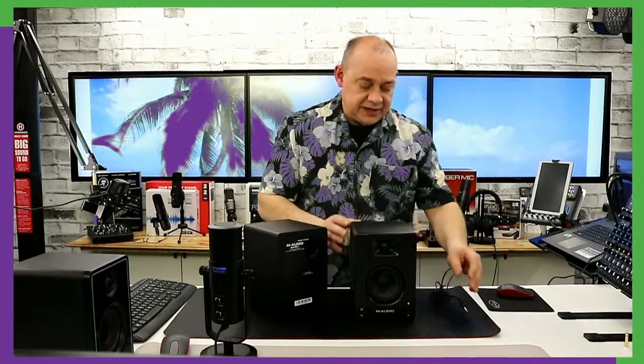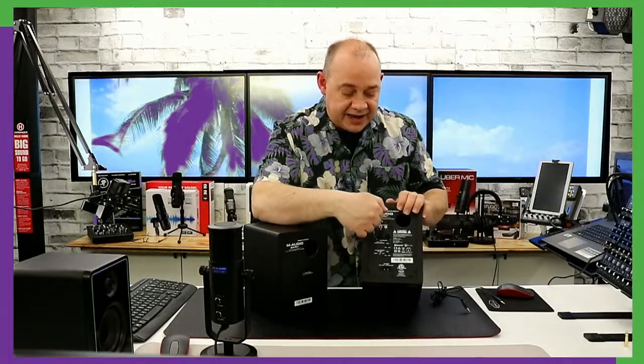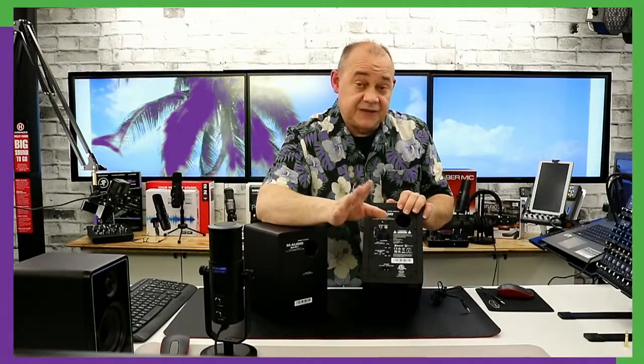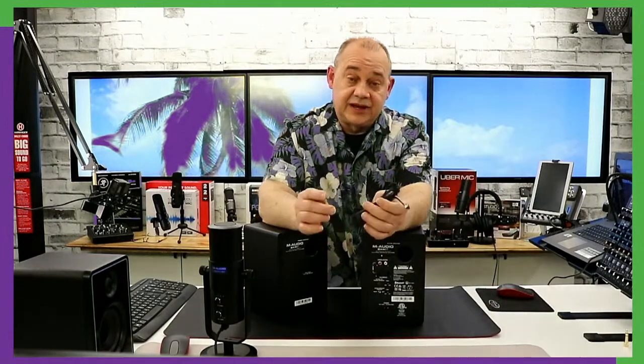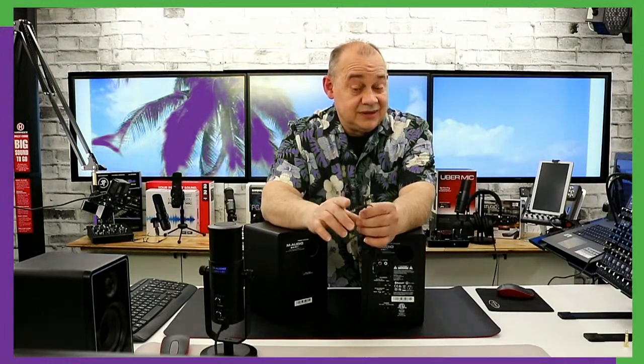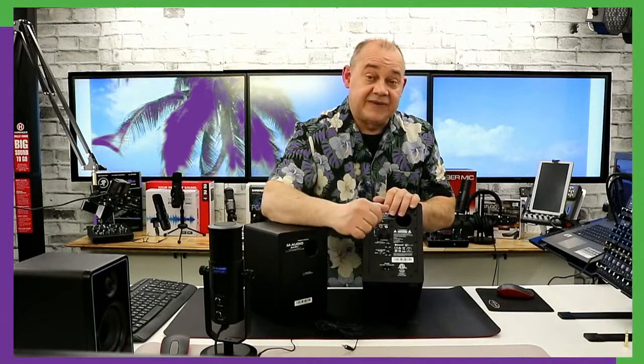Now, these specifically, it's the price point because they didn't skimp on the quality of sound. They just got smart about how to power the second speaker. And they're not shy. I mean, it's very important. There's two ways you can do this. You can go out and spend money twice and have both of your speakers amplified. And there's nothing wrong with that. But you're going to pay for that. You're going to pay for the benefit of not having this little cable. Doesn't mean you still don't have a cable. It just means you get to say, both my speakers have amp plates in it. You'll also get to say, both my speakers have power supplies in it and preamps and all those other things that cost money.